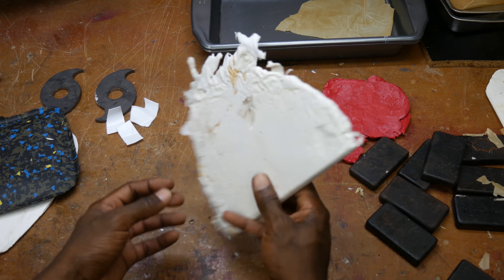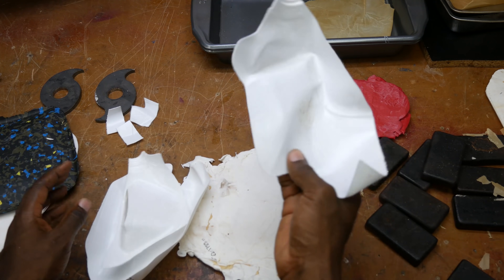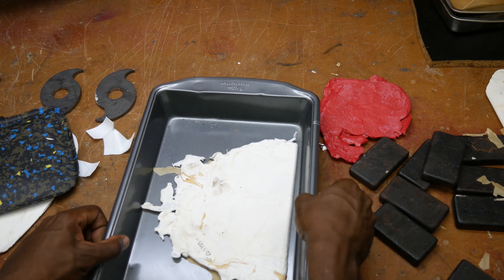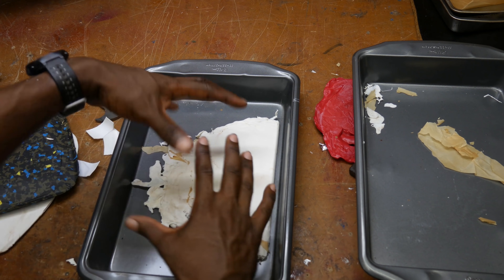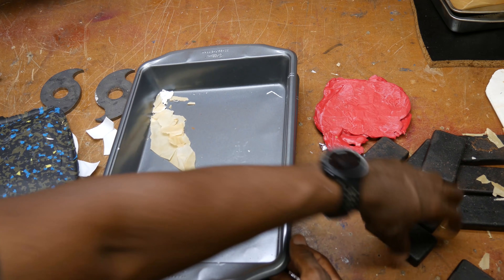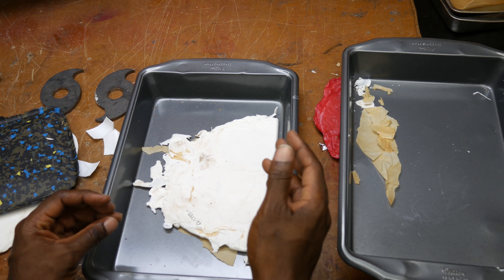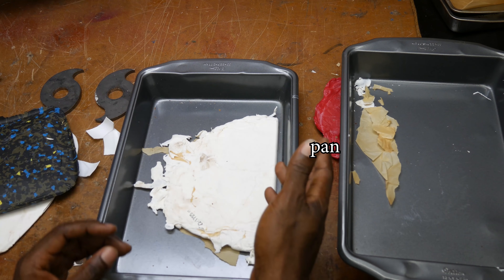The next sample — I put a little more effort into this, but the original pieces were similar. I only cut the milk jugs a couple times on the bandsaw to get very large rough-shaped pieces. I used a larger pan, but most of the rest of the effort was the same. The tricky part was it took a lot more time to get all the plastic into the container because the pieces were so large and unruly — they'd be cocked up like this and never quite sit flat. So I put all the weights on the inside and over time it would sink down as it melted, then I'd open it and put a few more pieces in. In my opinion that took quite a long time — the effort saved by not cutting smaller was just spent trying to get pieces back into the pan. This method was not nearly as efficient.